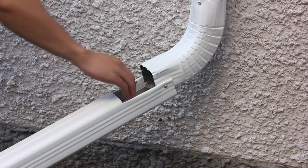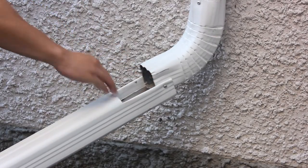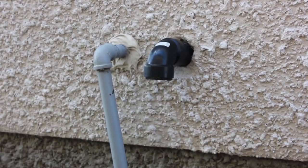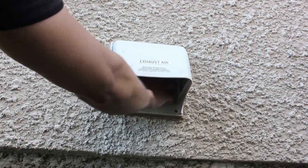In the fall, check your gutters and eavestroughs for leaves and debris and look out for any blockages at the downpipe connections. Remove exterior hoses and any divider manifolds or other attachments from the hose bib itself. Make sure to check all the vents outside of your home, such as the combustion vent intake, the dryer vent, and the range hood vent. Ensure that they are all clear and functional and have screens clear of debris.